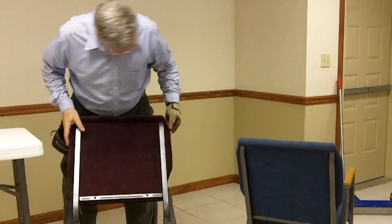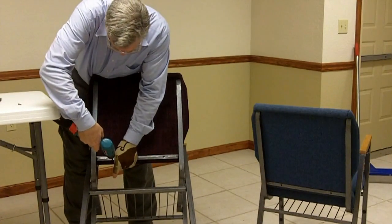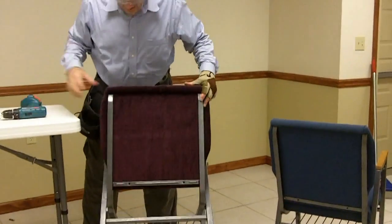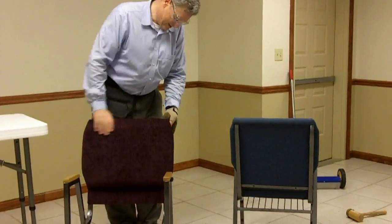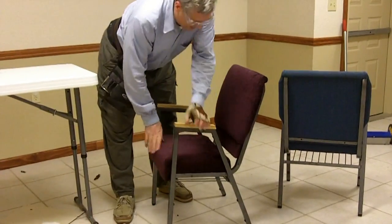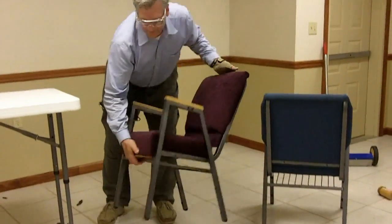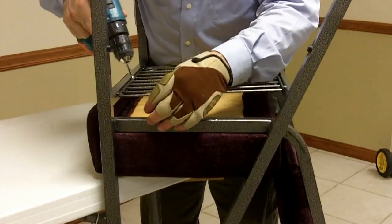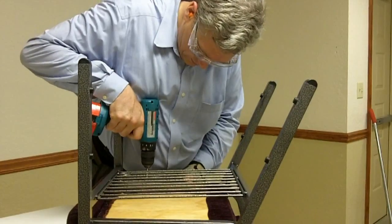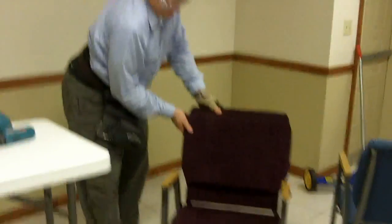That's it — in place. So we're ready for final assembly. At this point all the pieces are upholstered. We've worked hard to get the J-hooks lined up — the edge of the outside back and the edge of the metal will be covered. Install one J-hook, then the other. Nothing is showing — not even the staple that was colored. There's our finished chair — isn't that gorgeous and plush? Here's the seat. The seat goes in place, pushed back against the rail.